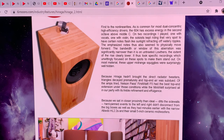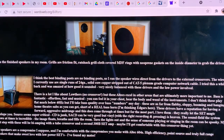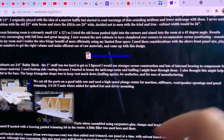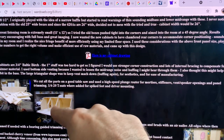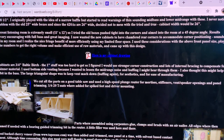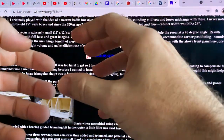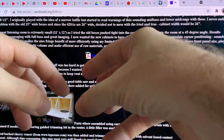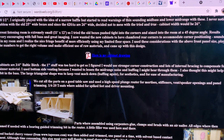The next step the loudspeaker industry made was to add dampening. The first strategy of dampening was internal bracing. Here is an example: instead of having a hollow cabinet, you start adding internal supports. Those internal supports prevent your cabinet from doing random warpings and random torsions — so it's much stronger. Your cabinet cannot warp this way or that way, and you will have a much clearer sound.